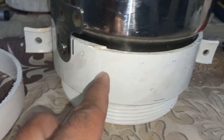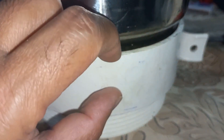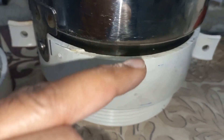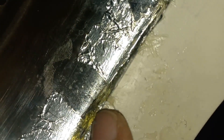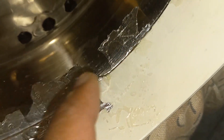I also cut a section of the shape so it was easier to fill the solution and see the level inside. I left it for 24 hours to cure. Now it's fully hard and will not open. The epoxy resin came out a little from the tape area and hardened completely. Two tips: use paper tape instead of aluminum tape so it's easier to remove, and remove the tape about 4 hours after filling before it fully hardens.